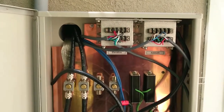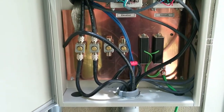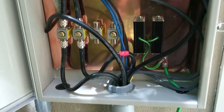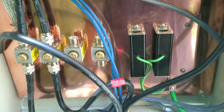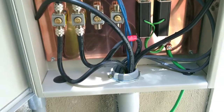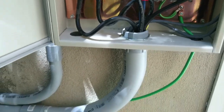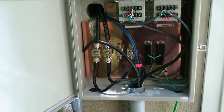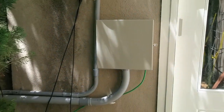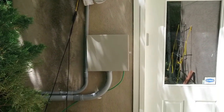He's got some arrestors for the rotator and the control lines at the top, and four alpha deltas — a couple for future use. He's also got his ethernet protectors there when he gets those ready to go. They all go through conduit, except for that green ground wire, which runs over to the tower. Real superb installation job. The knob looks really nice, and the color of the box matches the color of the house and the exterior. Really good job.